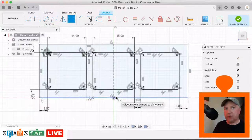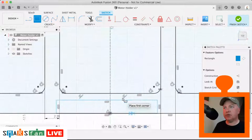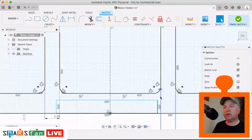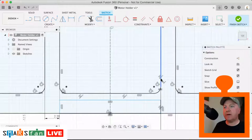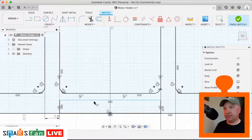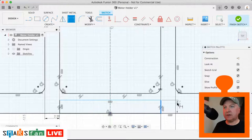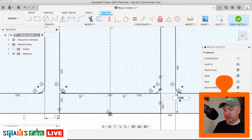So there's also another rectangle which follows very closely the bottom of that, and that'll become clear in a moment what that is. Just do that to there, and then we can just dimension that out. So that line there is collinear with this edge, so let's make that collinear with that edge there, and that is collinear with the edge there. Perfect. And then the height of this is 3, so height of that is 3. Is that right? No, sorry, it's 2.5.